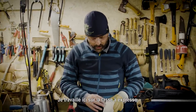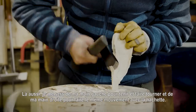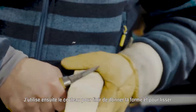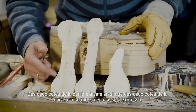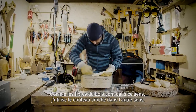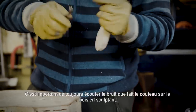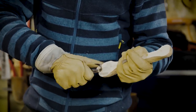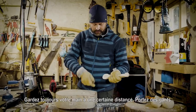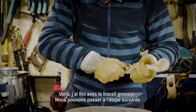I'm working here on the espresso cup. Use your left hand to control and to turn, and use your right hand to make the same axe movement. Now I use the wood carving knife to make it nice and smoother — a both-sided coffee scoop, both-sided spoon and espresso cup. Because of the veins of the wood, I can use this crook knife always in the opposite direction. It's very important that you always hear the sound of the wood carving. Don't use too much force — it will hurt your wrist. My hand is away, I've got gloves, and my thumb is always at the back.